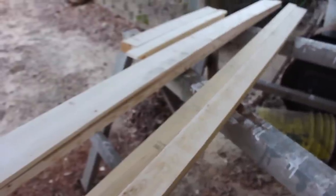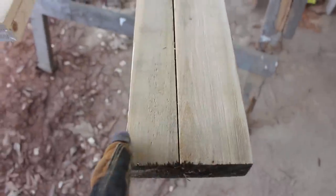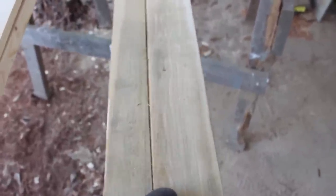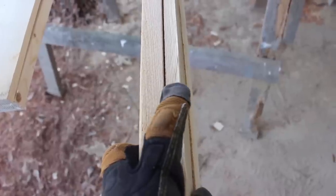Because I used to build door casings a lot - if this had been an exterior door unit I would have used treated lumber so it would never rot - but because this is interior I went with spruce. What I did was set my saw blade at two and a half inches deep and ripped the whole length of the board. Then I came back and measured over because I needed two inches, setting my saw blade at half an inch deep to rip exactly a half inch off.